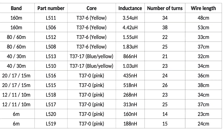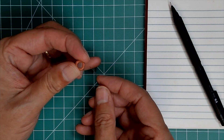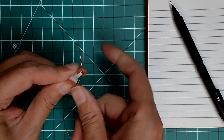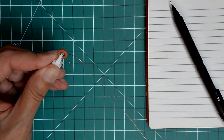To start winding a toroid, you need the right amount of wire. Kits from QRP Labs will tell you how much wire to cut off, and they're pretty generous in their amount, so there's no need to add more than they suggest. I start my first turn by pushing one end of the wire up from the bottom until I have a nice length of lead — this is turn number one. I then continue to wind, counting out loud each time I pass the wire through the center of the toroid. Be careful not to get any twists or kinks in the wire, and give it a good little tug to snug it up.